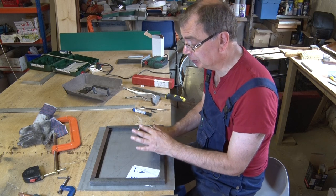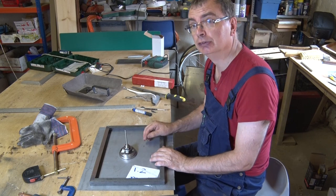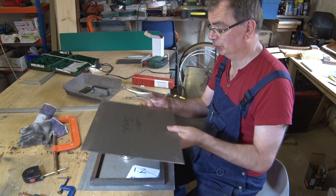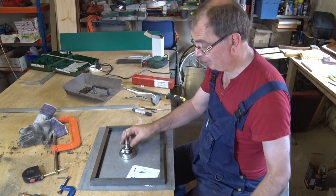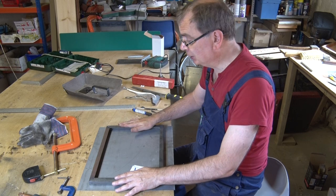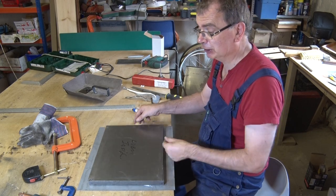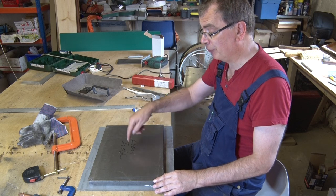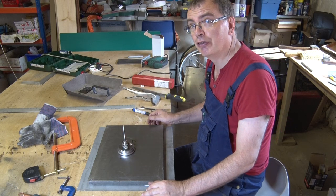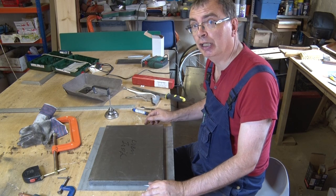One of the other things I've managed to get is a barbecue thermometer — I bought it in America and had it shipped over. This is going to fit on the outside of the oven door and the probe is going to come through. So I need to line that up so the probe aligns with the hole. What I shall do first is get this frame welded into place, put the face plate in position but not fix it, and then I can drill straight through one to the other. That way I know I can align the thermometer dial on the front with the probe.